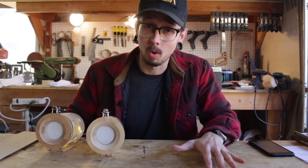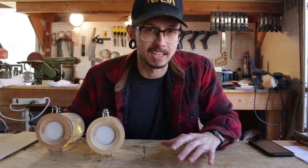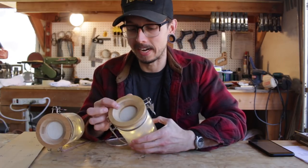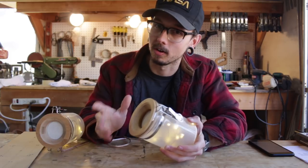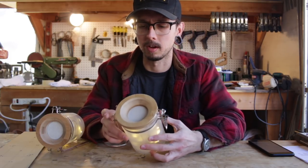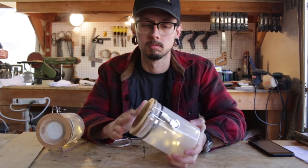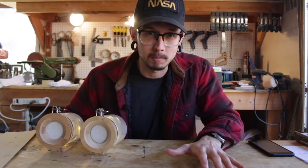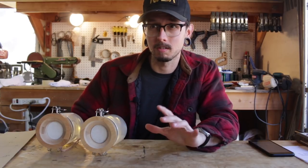Let's talk about the build. The construction on this was real simple. The only real construction we did was finding the center on the lids and drilling a two-inch hole through it. I then brought it over to the router table and routed out a chamfer on the inside edge of that hole. I know not everybody has a router and router table, but there are creative ways to do similar effects, or you can just front mount the speaker onto the front of the bamboo. The wiring for the amp and battery on the inside may seem a little daunting, but it's really, really easy. I have free plans on my website down in the description.